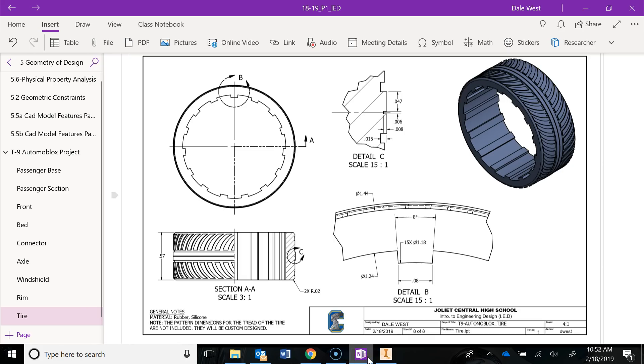Let's take a look at the OneNote binder. In here you're going to see a top view with a half section in the front view. You've got an overall height and the fillets. You'll also see a detail view here and here as well — this detail view covers those little tabs as well as the overall diameter dimensions, just a little bit easier to see when that detail view is blown up. This other detail view is mainly focusing on those middle two rectangular treads. I'm not giving you all the dimensions to create this part of the tread — I'm going to go over how I did it in the video and you can follow along. Notice the material has also been changed; it is a rubber silicone so it can flex and move with the rim when we put it on the rim for the T9.